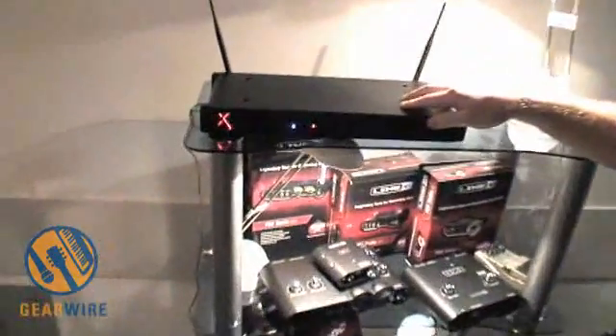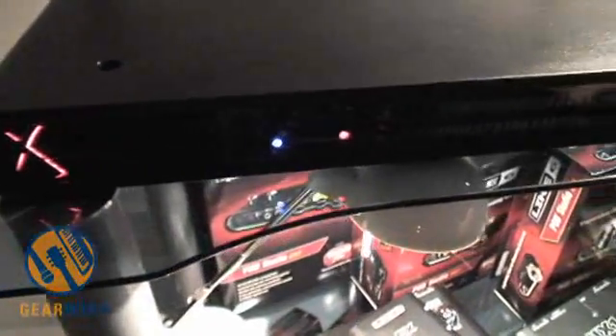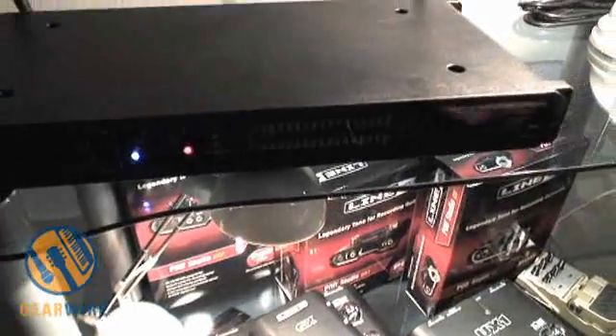The second part of our microphone story is that we operate on what's called an ISM frequency band, which gives us a microphone that doesn't require a license — which current UHF microphones actually do require. So there's no license to get, and we are completely immune from the digital television switchover, from white space devices, any of this stuff that comes into play over the next months or years. We simply operate in a different band and we're totally immune to all that changeover.